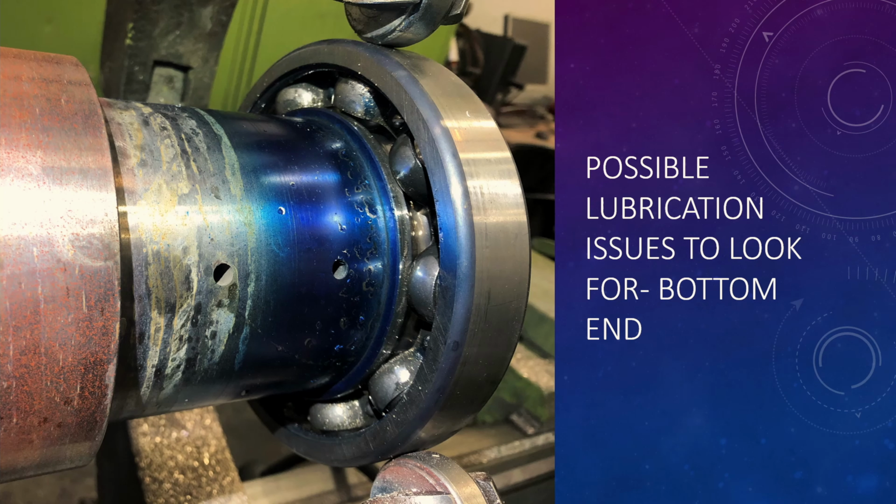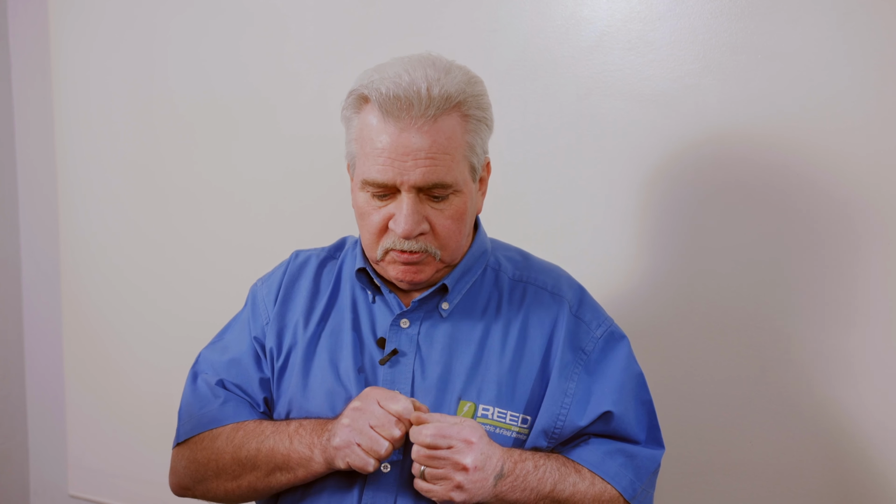To give you another example real quick while I'm thinking about it, we had a customer in Fallon. He was using 220 Mobil instead of the 150 weight, and it coked, meaning it turned the oil cooling tubes that were nice shiny stainless to a black coating that you could take a knife and scrape, with carbon coming off of the tubes. So it got so hot it wouldn't dissipate the heat anymore. So we ended up getting them to go back to the 150, and they pretty much solved their problem with that. That can also cause issues with the paint peeling off too.